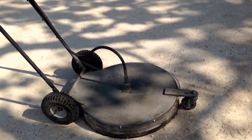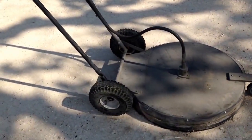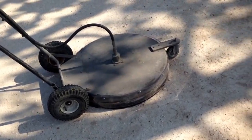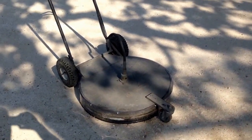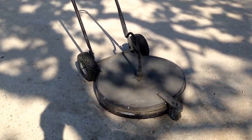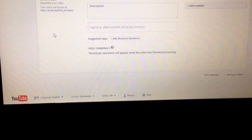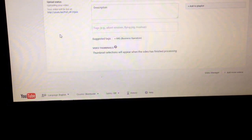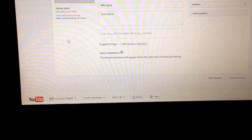If you hit a bolt, it's not gonna let the bolt pass underneath, or a ridge — it'll keep your tips safe. We were tearing up tips and bars until I put this on. We've been running about two months and haven't had one tip issue or bar issue, and nothing's really changed besides that piece on there. That plastic is eight feet long by three and three-quarter inches wide — I think I said the opposite earlier — and I just paid 20 bucks for it at a plastic place.